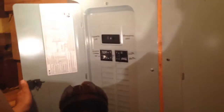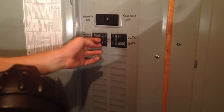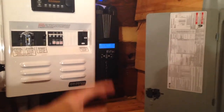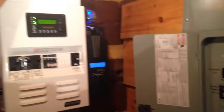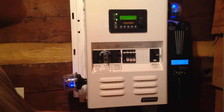If you don't, then what you'd want to do is — of course you can always turn your generator on. In order to turn your generator on, you'd have to go ahead and turn it on out there, then hit this on breaker, and let the power feed through into the inverter, which would charge the battery up. If for some reason the inverter still wasn't powering up the house when you turned your generator on, you can always take this inverter bypass breaker and flip it up. That will bypass the system and the generator will be able to power the house directly.